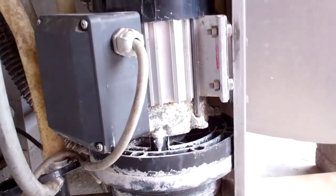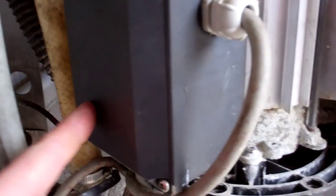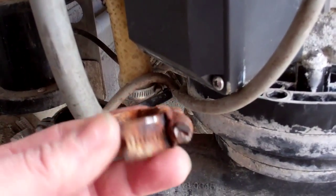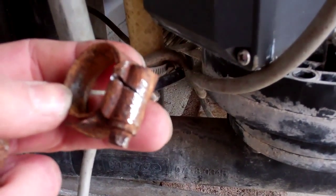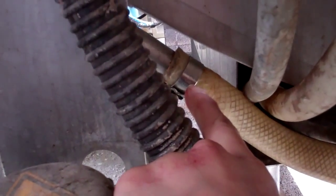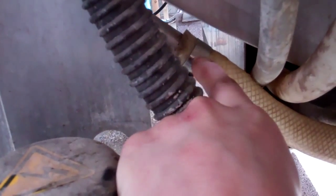Right, we've got the pump back on there, checked the capacitor - checked out okay. Now we had to cut the jubilee clips off. Somebody had used normal steel ones and they should be stainless on these things. I've got a new one on there.